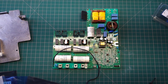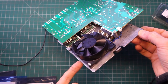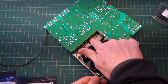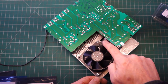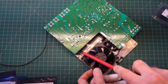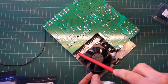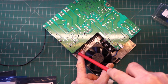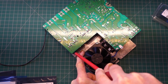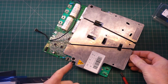I just thought I'd show you getting the clips on - I've got two out of three on, the third one's yet to be clipped in. They are a bit tricky and tight but not horrendous. I put a small amount of heat transfer compound on the backs as these were all dried out. Using a screwdriver blade with one side clipped in, I apply pressure with my fingers behind the blade so if it slips I won't hurt myself. There we go - nice firm clip, all done, ready to be reinstalled.